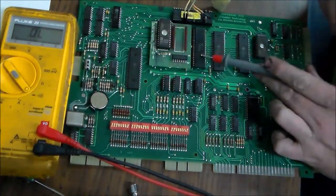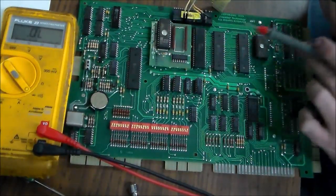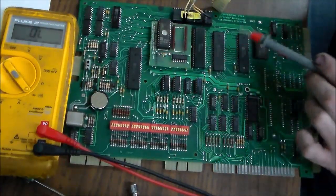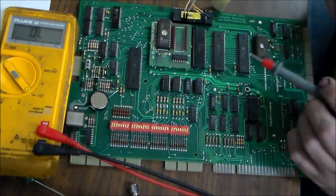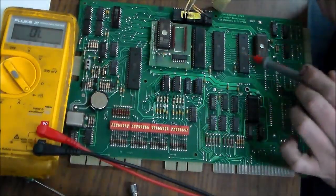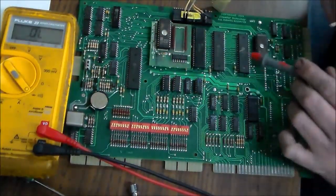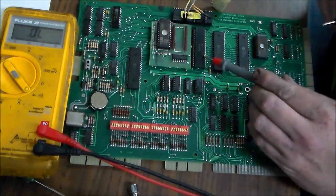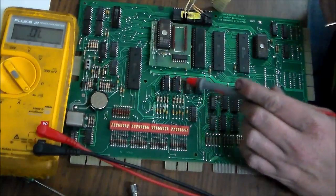Okay, so this is the switch one, and like I said, it was getting really hot, burning hot. So we know there was some kind of problem there. After I've swapped it, it no longer is getting hot. It still gets a little hot, but nothing like it was. And these run a little hot too, but that's just how they run because they're RAM chips. So this handles all of the switches, and the switches are handled by these two chips.